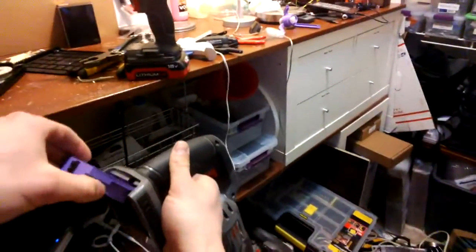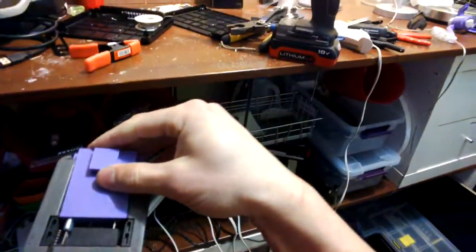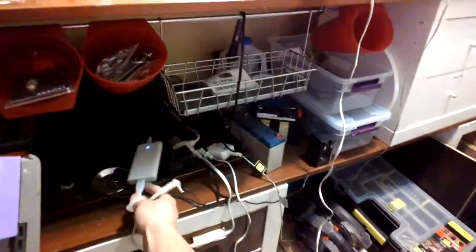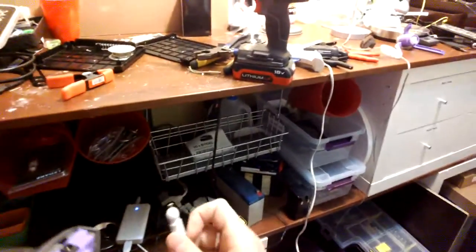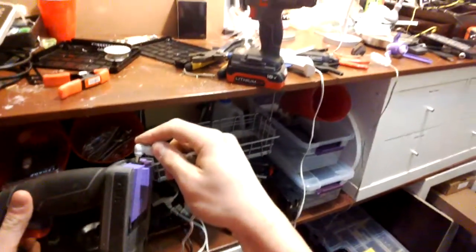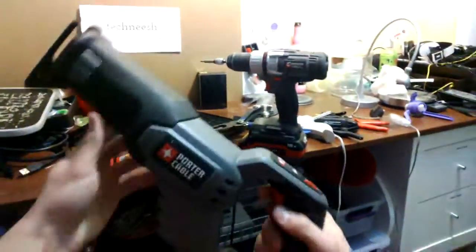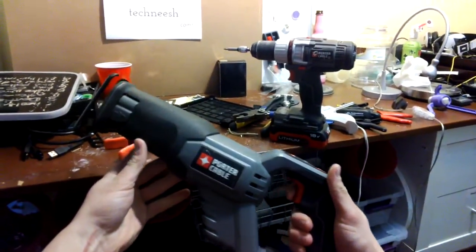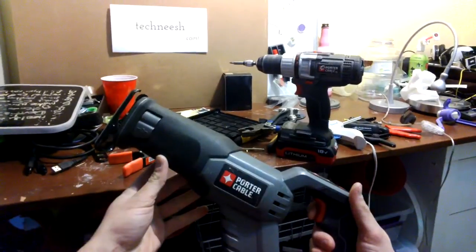It has a perfect pinout to slide into your normally cordless tools. It looks like this and you just push it in like that. I had this extra 18-volt transformer lying around — it's only 4.5 amps, so that's not that much power, but if you start out slow it will still run a Sawzall and circular saw.